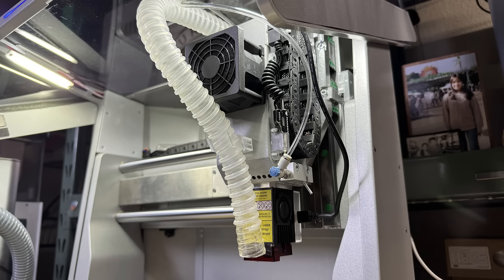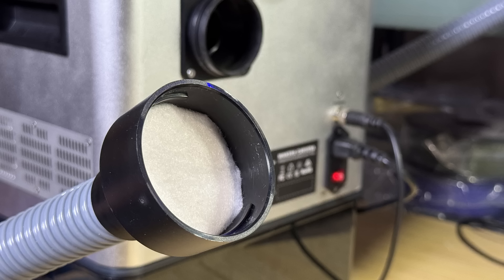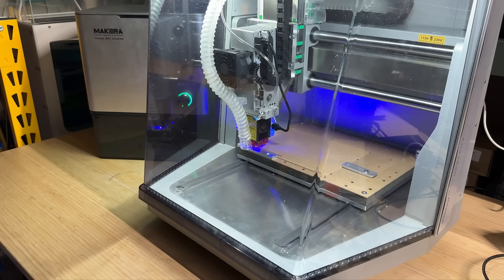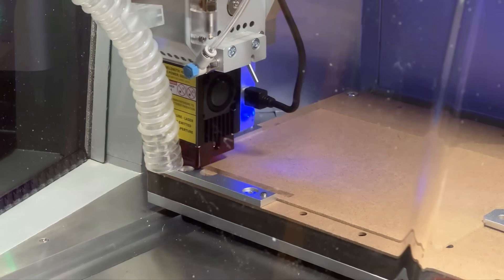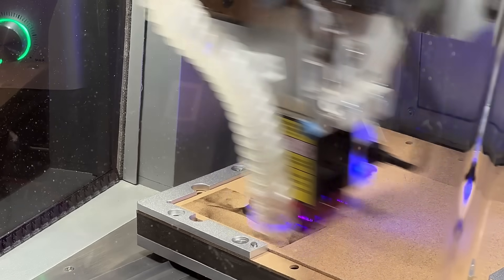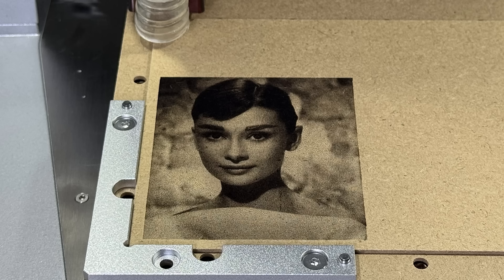Finally, I will test it with the laser module. As it came with some extra round cotton filters that fit into the hose, I will put one inside to filter the smoke and extend the lifespan of the HEPA and carbon filter. The laser module is just 5 watts, mainly for some light engraving. I will run a sample photo engraving job on a piece of MDF. A 5-watt module actually gives better results than higher power modules in terms of photo engraving. After taking out the cotton filter, you can see the smoke is filtered out. If you don't add this as a pre-filter, all the smoke will get into your HEPA and carbon filter, which could cost more if you have to replace them frequently.